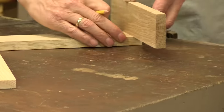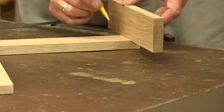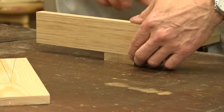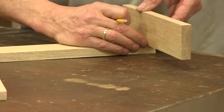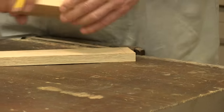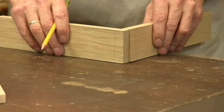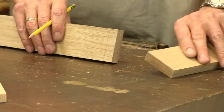I'm going to get the width of the adjacent piece of wood onto the end of here. I've already squared the ends of the piece of wood. I'm going to do the same on this one here — flushing it with my fingertips on one side, and that's just a rough guideline. I'll be squaring that with a knife wall soon, but those two lines represent the thickness of the piece of wood. So I'm going to make the dovetails on this piece and the pins on this piece.